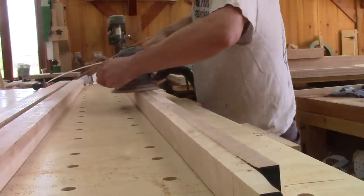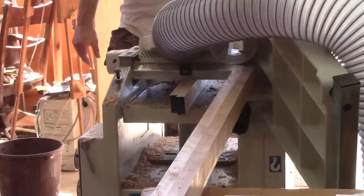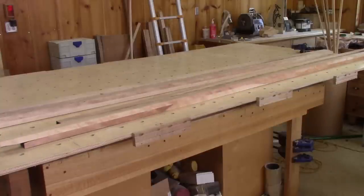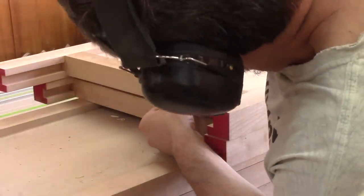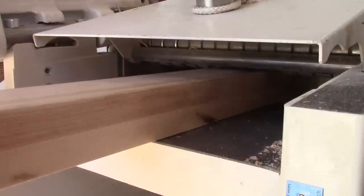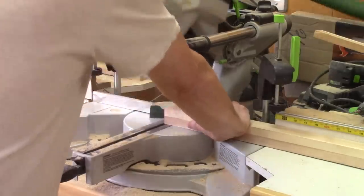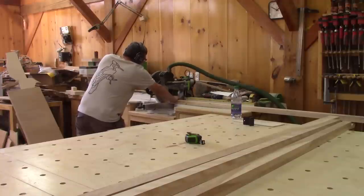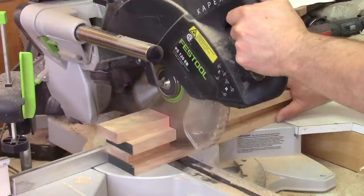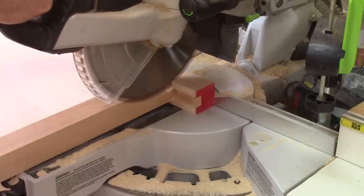For the top one, I remove the glue bumps before planing them to their final height. Now the four stretchers have the right height, but they are too thick compared to the ones on the frames. I fix this right now. Done — it's time to cut them to the right length. Now that it's done, I need to cut the excess wood on all the frames.